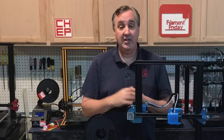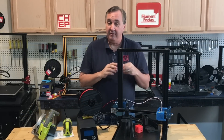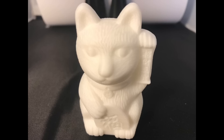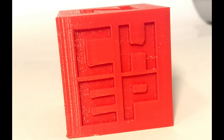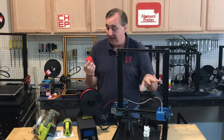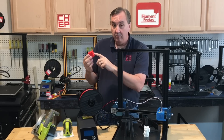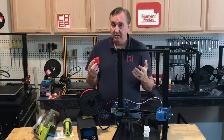It definitely has hardware improvements over the CR-10, but does the print quality improve? The first file I printed was their sample cat file — the same file from my original CR-10 review — and it looked really good. Then I printed my check cube upsized 200% to test bridging for the letters, and the cooling was no different than any other printer. I also checked for ringing — a glass bed typically gives more ringing on the Y axis, and there was definitely ghosting on the Y, which is typical but nothing unexpected.